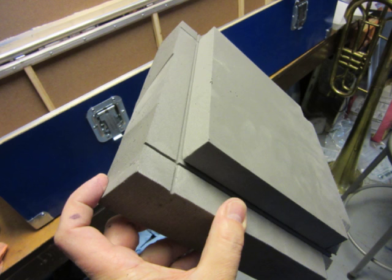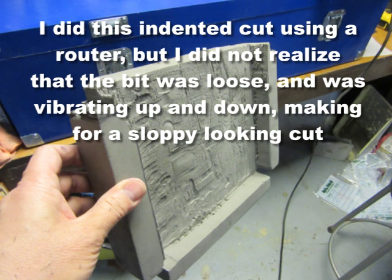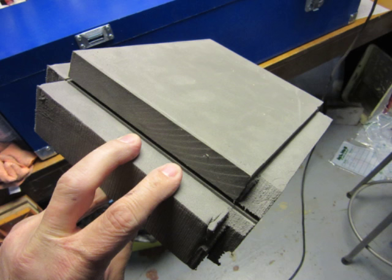This foam is, by the way, got characteristics of being very soft but yet firm. It's not going to scratch an object or mar it, and it will not, even if it's a little bit loose while the instrument or other object is in transit, rub shiny spots or anything onto the instrument. So it's almost like it's being held in kid gloves. It's chemically inert, the polyethylene. It will not deteriorate over time, crumble or get soft or sticky, as other types of foam often will do. It will not absorb liquids, including valve oils or greases. It's firm enough that it can be machined, as I mentioned, with regular saws and routers and things like that.